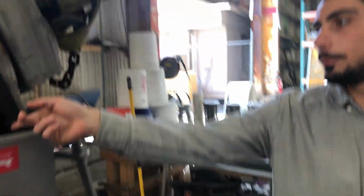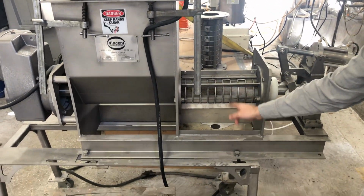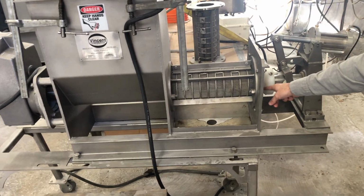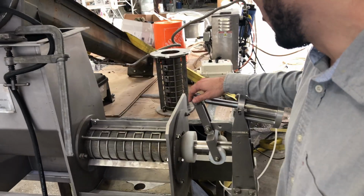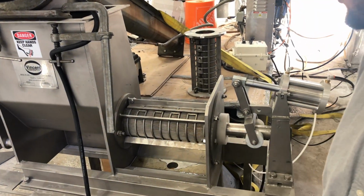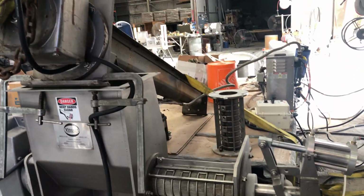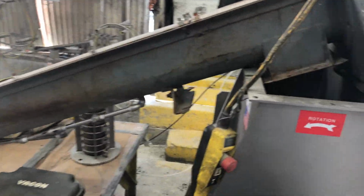into the hopper. In go our warm hemp hearts, and we press out oil from the fiber, which will come over from here. So we'll use a cone to supply the back pressure in order to make that separation happen. And let's begin feeding. Okay, so we're starting to get some hemp hearts going into our screw press. Take a look at the inlet hopper in there.